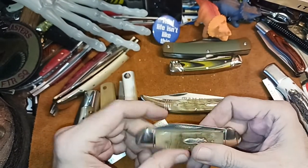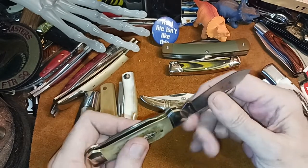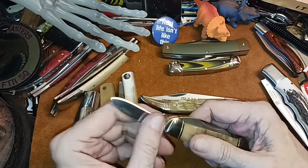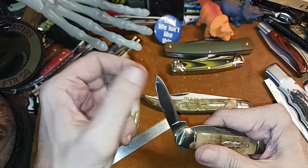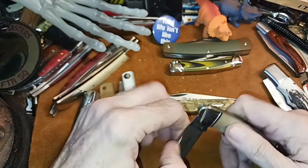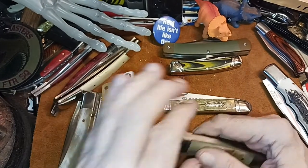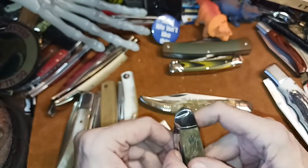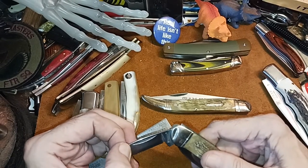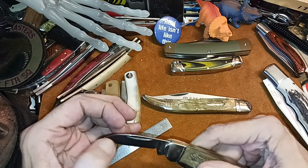There's no half stop. This one hasn't been cleaned or anything — I can tell it's just got a little bit of grittiness to it. I haven't cut anything with it. This one doesn't have much of a snap coming back — it kind of just loses its momentum. I like a blade that not just snaps shut but snaps open. The pin blade is not doing that. Now if you put some KPL on it and work it back and forth it'll probably get there, but there's a lot of friction right here. By the time the friction gives up, it's time for lock up.